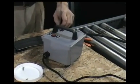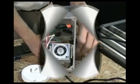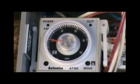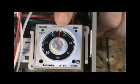remove the four screws on the top of the control box and lift the cover to expose the timers. There are two timers: a heating cycle timer and a cooling cycle timer. The heating timer is shown on the left and should be set for two minutes. The cooling cycle timer is shown on the right and should be set for 0.25 hours. Turn the dials in the center of the timers to adjust the timer settings if necessary.